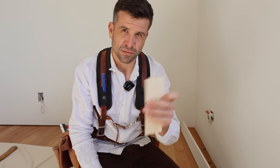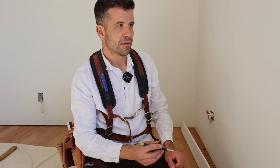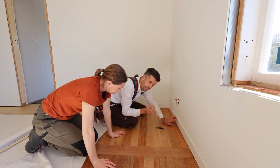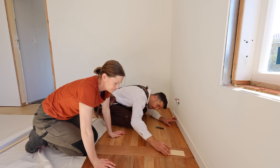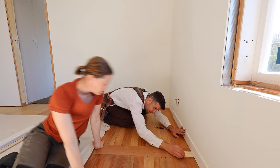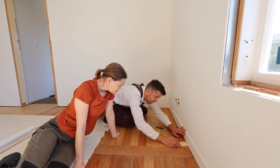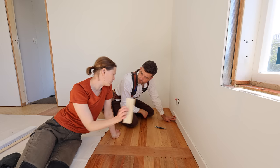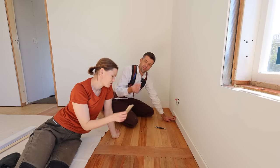In order to scribe to the floor there are many ways — I've just ripped this little piece here that's about three to four mil thick. It's nice and smooth so it won't scuff up the floor, but it gives us something to scribe against. There are many ways to do this; this is just how I'm doing it. What I'm looking for is the biggest gap, and I'm hoping that this packer I've ripped is at least as thick as the biggest gap — and it looks like it's not perfect, it could go a bit more, but I think we're going to have to live with that.